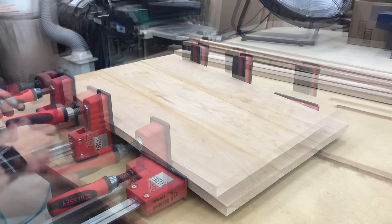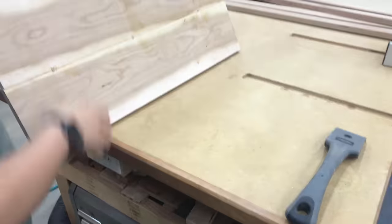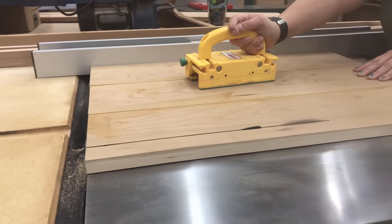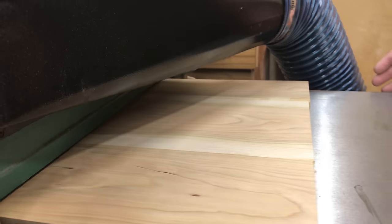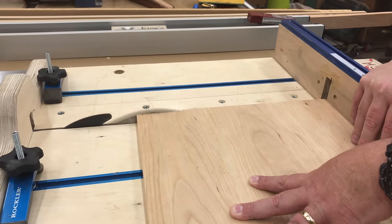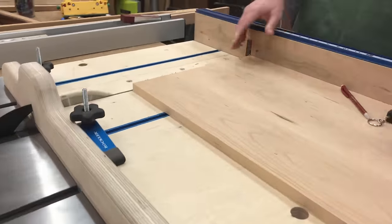We've let the top cure overnight and we're going to take it out of the clamps and cut it down to the correct size. I need to get this piece just a little bit narrower so I can get it through my jointer and clean up those glue lines. If you have a planer, that's a quick and easy way to get all of those surfaces down to one flush, equal level — if not, you can certainly sand it. After that, we'll take it back over to the jointer and joint both sides. From there we need to cut it to exact length and it has to be perfectly square — the best tool in the shop for that is a crosscut sled. I've got a video showing how to make one and I can put a link in the description.